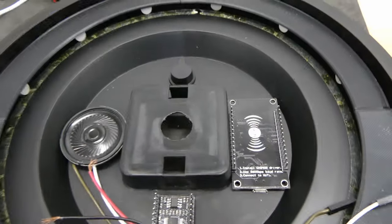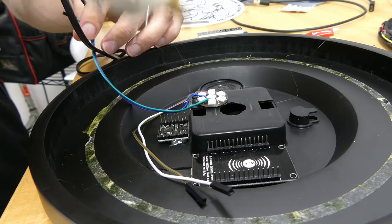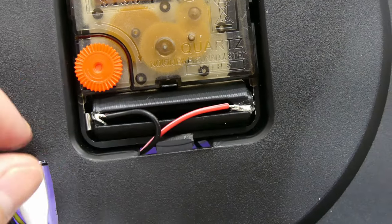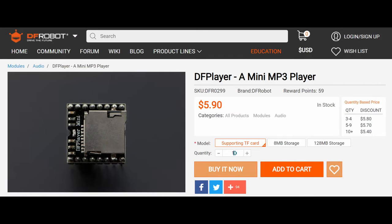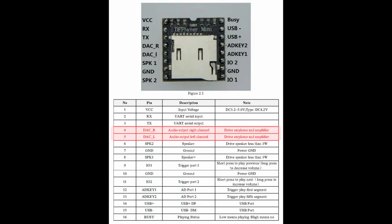As I mentioned earlier, this clock provides a nice area to mount the electronics. These are where I mounted the components and I just hot-glued them down. I positioned the DF Player Mini close to the edge where I could still access the SD card to update the audio files if needed. The DF Player is a sound module that can play thousands of MP3 files from a mini SD card. It's very small so it will likely fit in your project too. It has stereo output for headphones, amplified 3-watt mono output for a small speaker, and you can control the file it plays through serial or analog inputs. It's really simple to use, and the link is in the description.